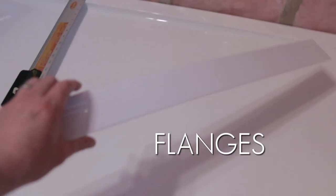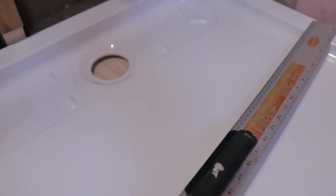Something else to note with the dry fit: I don't have the edge guards on yet — the pieces that go around the edge of the tub to keep water in. That's going to add about an eighth of an inch to the tub. I'm already pretty tight on the floor, so I don't have that eighth of an inch and I'm going to have to cut back a little more unfortunately. But it doesn't change the drain location, so I'll mark that and start installing the plumbing.